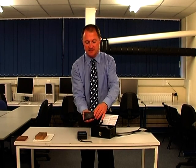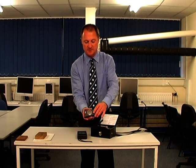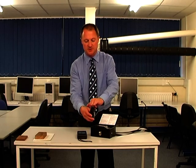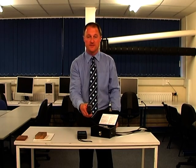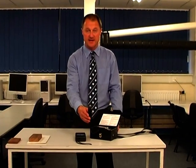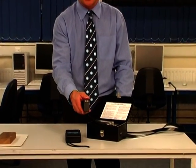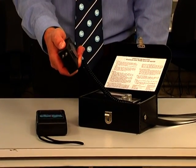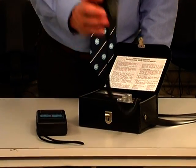The smaller electrodes mean that it doesn't transmit as deep into the laminate or the wood structure. The Sovereign also has two pins, and they can be used for measuring timber using the more conventional resistance method for measuring moisture content. To get the two pins to operate, you hold the red button down and then read off the dial.